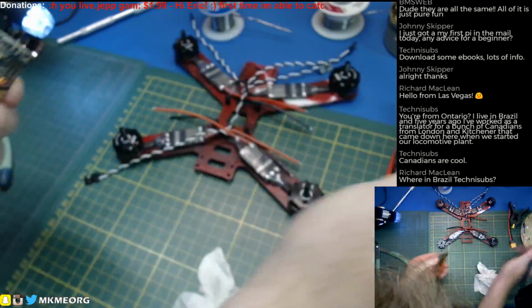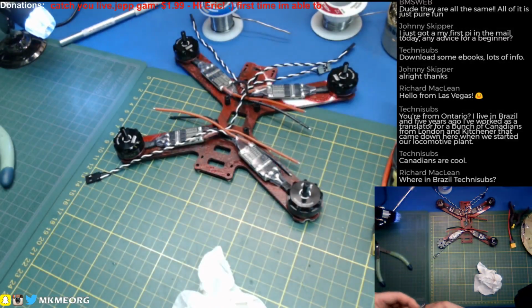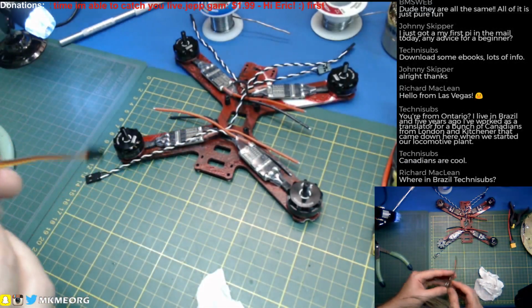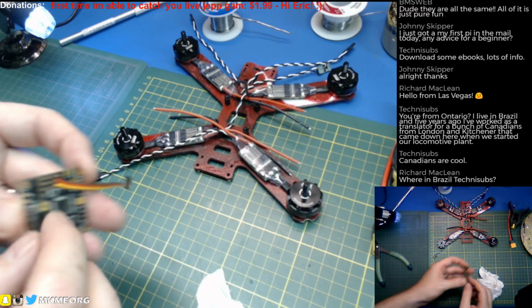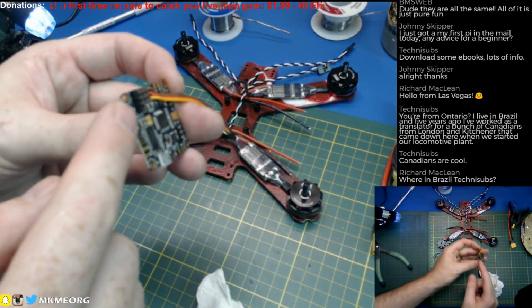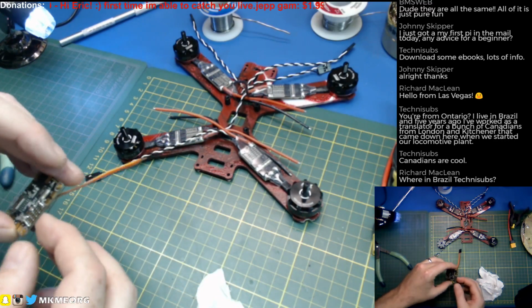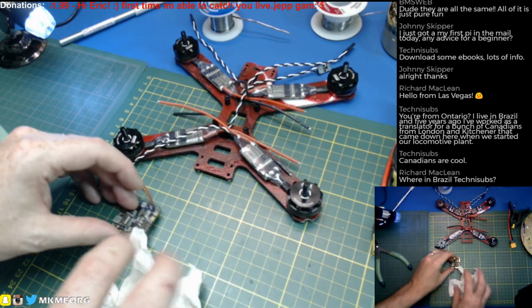Not so crooked now. It's alright, we're going to be trimming the pins off nearly flush anyway, so it truly doesn't matter. We're going to be trimming them off right down low to the board. We're just going to use them to solder to. In fact, what I'll do is take that little black isolator, pin separator right off. It'll just slide off, and then we can solder right down on the pins, and it'll be much easier, because